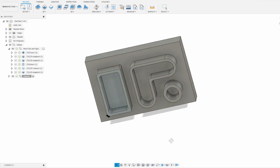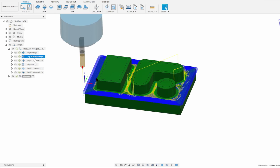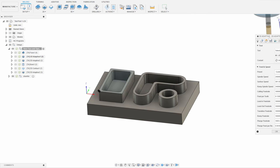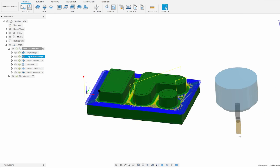What I'm going to do is machine this 6061 aluminum test part with the correct speeds and feeds for a 4mm 3-flute carbide end mill as calculated from the MachiningDoctor.com calculator, but I'm going to crank just the feed rate of the machining operations up all the way to 10,000 mm per minute rather than the recommended roughly 3,200 mm per minute.